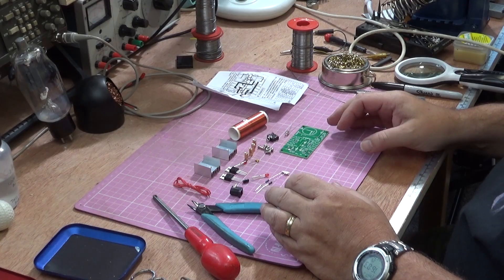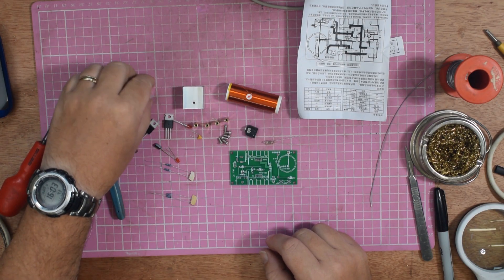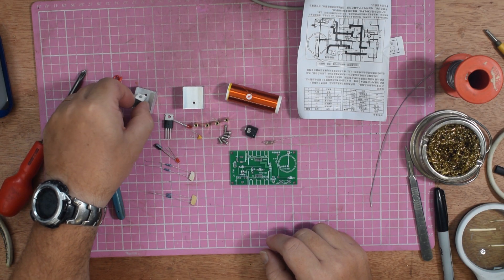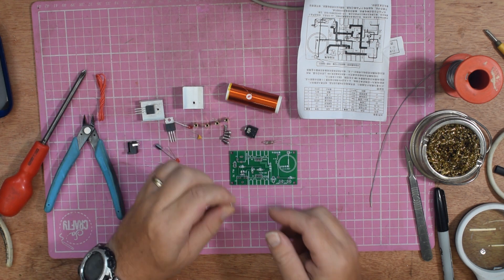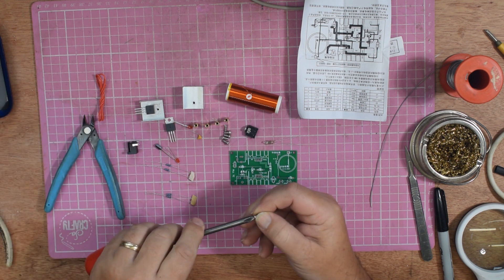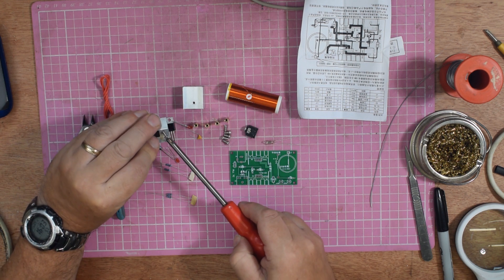And that is all we're going to use to put this together. We're not going to make you need any sort of major test equipment — just those basic things. We can start off by putting the transistors on the heat sinks. These are not earthed; they don't need insulators — they just work as is. That's one of the simplicities of the design. Let me just check the screwdriver — yes, it fits the screws they supply.